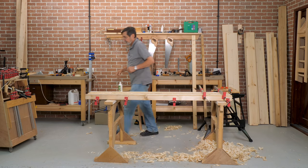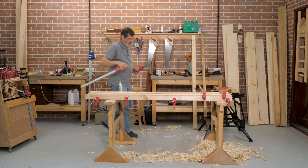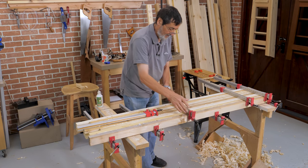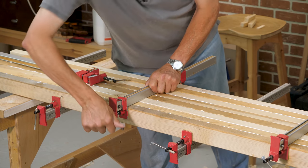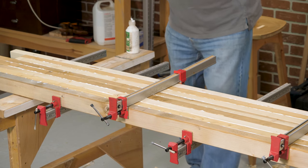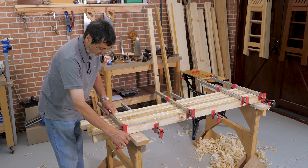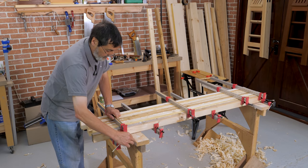We'll need to come back in and add a little bit of extra pressure. So we can go in here, this one. And then keep your eye on the glue lines, because you can just keep adding extra pressure. I'm going to go nearer to this end. These are fairly close together. This clamp evens out this one where there's no pressure on this side.